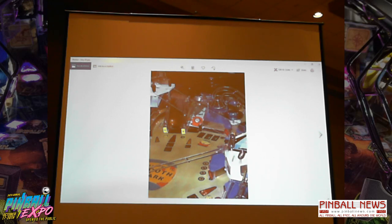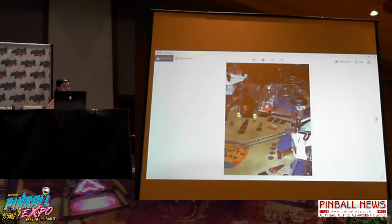There's the three-bank in a down position that feeds the upper playfield. There is a huge orbit from the upper left flipper. The left ramp is from Popeye with a modified Twilight Zone wire ramp attached to it. And the game shot okay. It was a wide body, and I'm not a fan of wide bodies. So I was never a huge fan of how it shot in the end, but it's an important lesson to learn. I pretty much routed all this by hand.